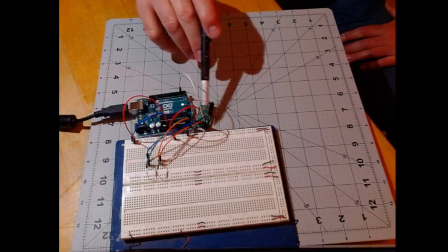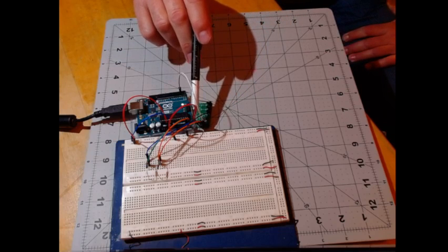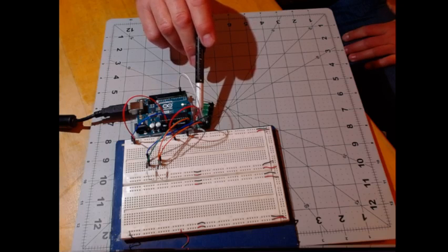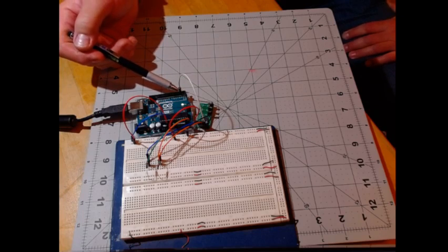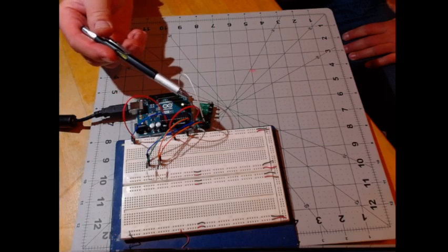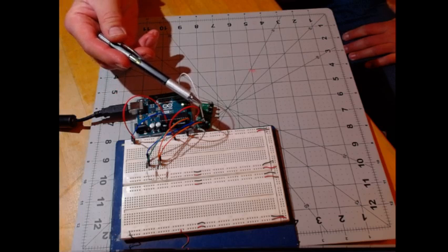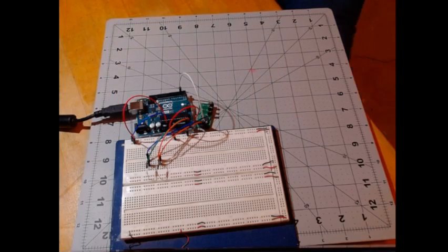There are 5 wires that connect to the temperature board. The first one is the 5-volt power. The next ones are SDA and SCL, that's for I2C. The white wire gets connected to pin 2 in the example code, and that is an alert or an interrupt, and then finally ground. So let's go ahead and switch over to the interface.